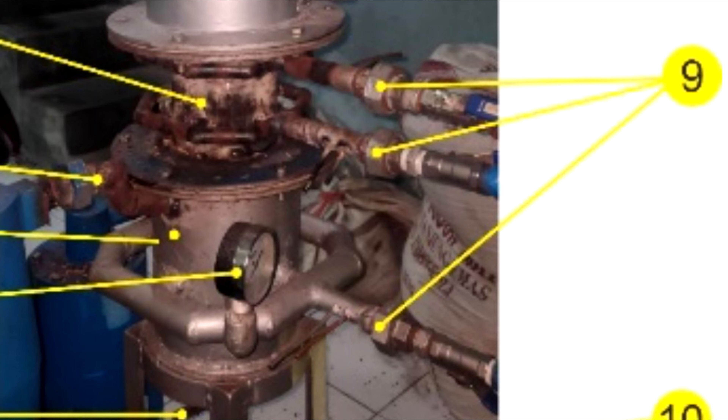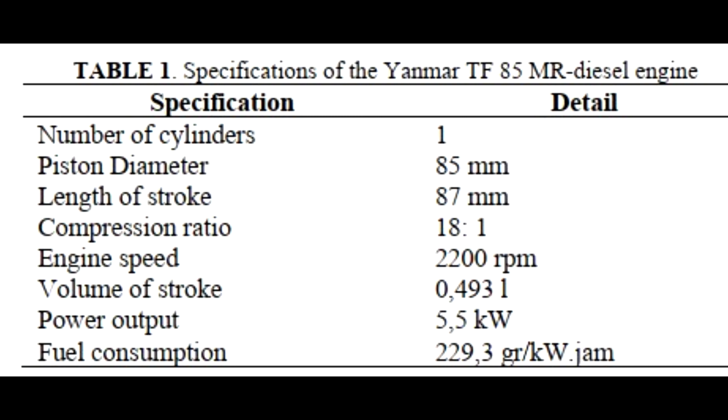And that's not all. Into the lower belt he supplied air at a height of 60 millimeters above the throat with a diameter of 42 millimeters. It turns out that under the gasifier with two tuyere belts, he also installed an Imbert gasifier with a throat at the bottom. The gas was supplied to a diesel generator with a power of 5.5 kilowatts and a compression ratio of 18.